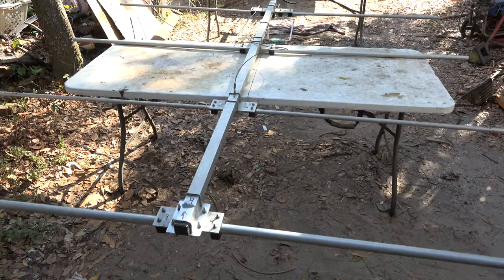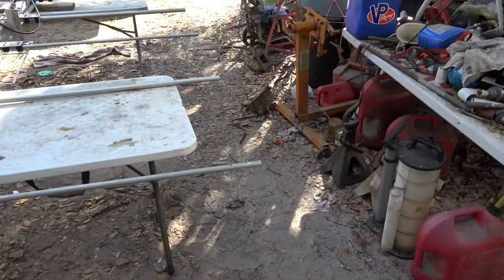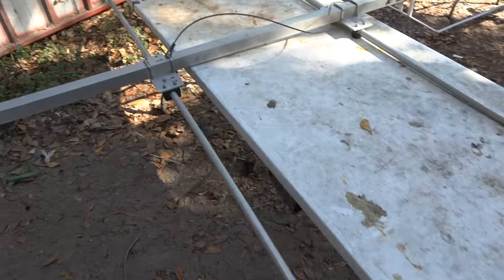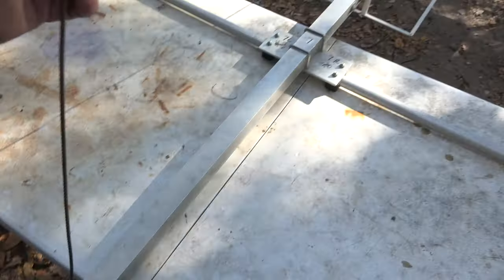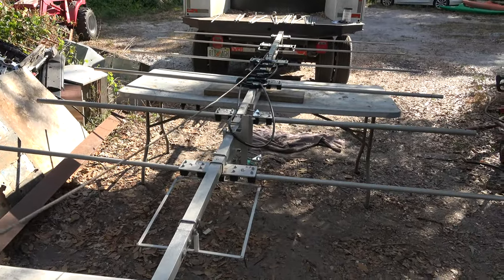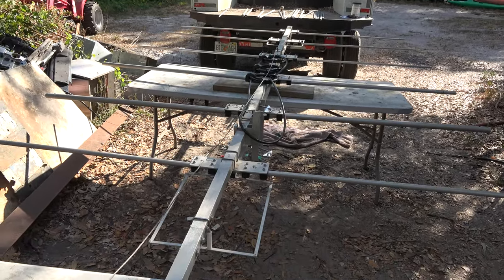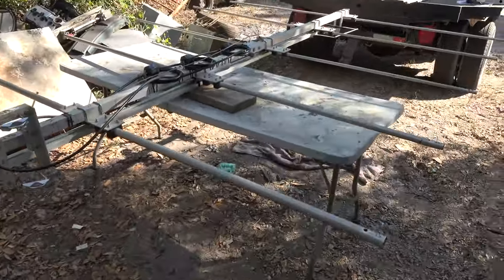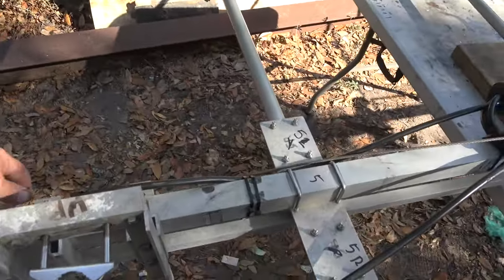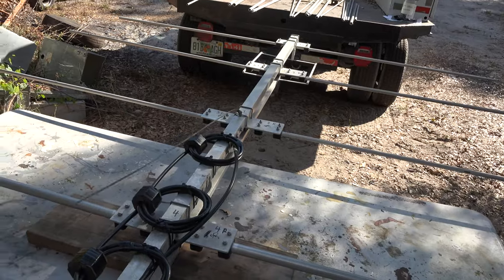So I got the antenna turned around the way it's gonna be mounted. And I put the cables on. I'm just gonna go over a few details here too. So on the eighth element, there's gonna be a steel cable attached. That's gonna go all the way up to the third element. And it's gonna support the weight of the boom by fixing that cable to the mast somewhere like here. It's gonna be a mast, and it's gonna be higher, and it's gonna support the cable, the boom, I mean.